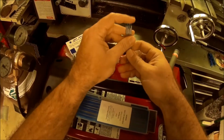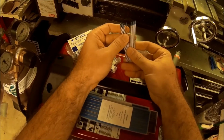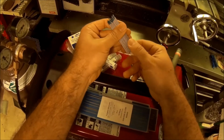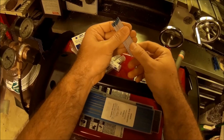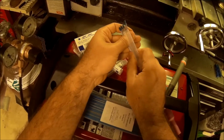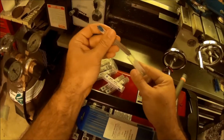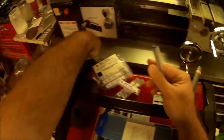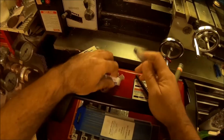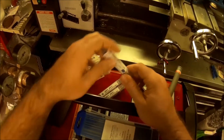Here's the 1/16 inch. This is 14 of these guys. They're all precision ground, and you can see here, as you roll it, none of these things are bananaed out. They're all precise and very, very straight. They load into the collets without jamming, and then they stick out and stay concentric with your cup, ceramic cup or Pyrex cup, whatever you want to run on your setup.